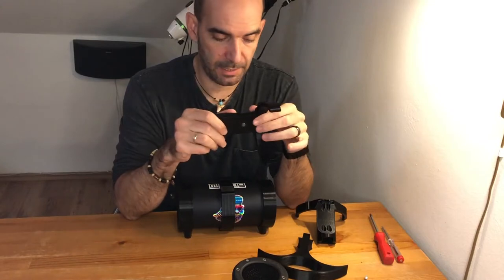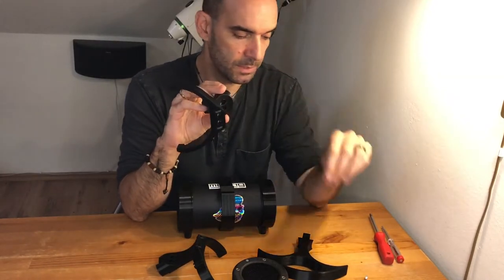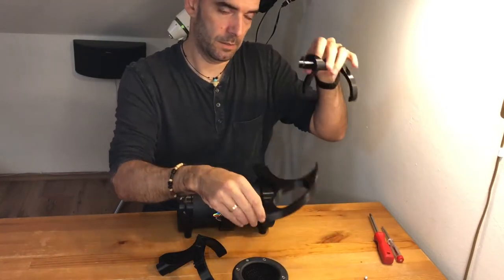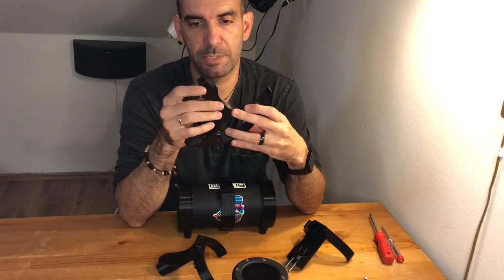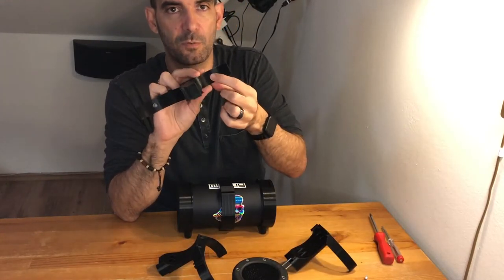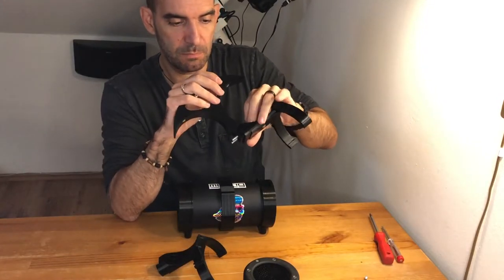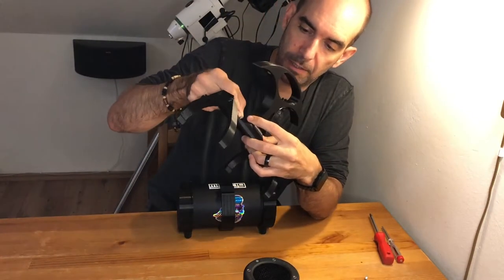Now we put together the clips and the handle. I recommend using the clips with the round holes first because the screws go in first. Two screws go in — one, two — push it in, and then comes the holder, the handle. The handle has a new design; in the old design there was no stabilizing of the sides. Now it's more stable because it lays on the surface so it doesn't move at all. I integrated two silicone pods inside which make the ring fixed very firmly with no vibration — this is very important. So I put it together into the screws on both sides, and then you put in the two nuts.